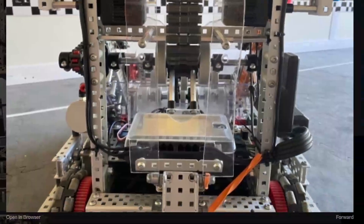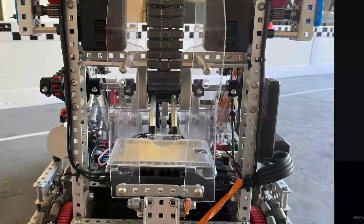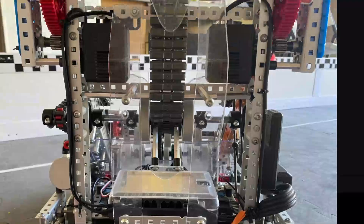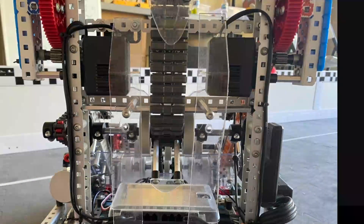This one's interesting. We have the plastic sheet on the back to keep the ring further away - I like that. And then there are two 5.5-watt motors. The advantage is that we're currently using one 11-watt for our lift, and the problem is that one of the sides usually lifts higher than the other, because only one side is giving more power. With two 5.5-watts, this really distributes the power quite well and makes sure both sides go up and down at the same time.